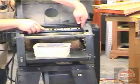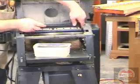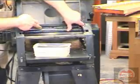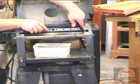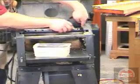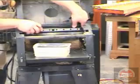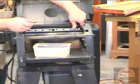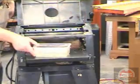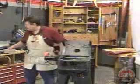If you open up the hood of your planer and see that there's a lot of brown yucky stuff, resin, clinging to the knives, a little bit of oven cleaner will take that off. That can also make the knives act as if they were dull.